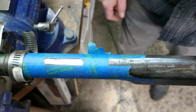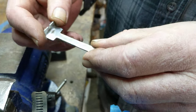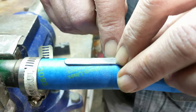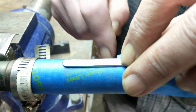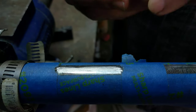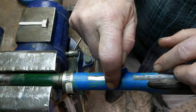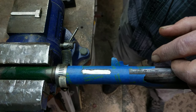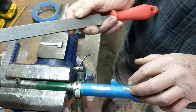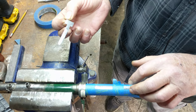Okay, now we're on the bench. We've got a sample receiver set up to show you how to do this process. Whether you've elected to use a fabricated sight or the factory original sight, the first thing you need to do is get it in position on the receiver and trace an outline of where the sight's tang will sit, because you want all that silver solder to stay under there — you don't want it to bleed out to the left or right. Once you've got that outline established, I like to take painter's tape, put that around the outline, and then get after it with a fine hand file and take off any oxide coat, rust, or surface debris prior to using the silver solder. Do the same thing with the underside of your sight assembly — make sure that's clean.